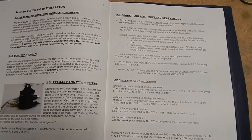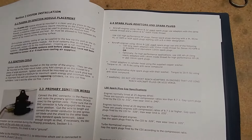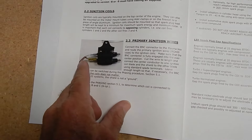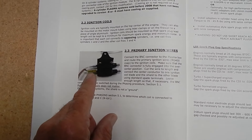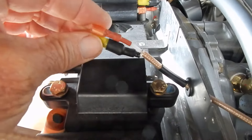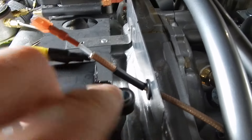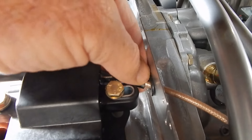There is an installation manual for the Plasma 3 coils and ignition system. Getting into the beginning of it, they talk about the connectors using coax 400. They say there is no polarity issue — this is not a ground in this system, and it says it can go to either post. It basically says connect these crimps to the end of the coax. The other thing is when you get these finished, the distance between the grommet and the pegs is very short. I've had to unscrew the coil, move it forward, attach them, then move it back — it's a very tight and uncomfortable fitting.